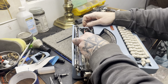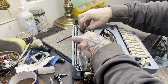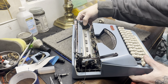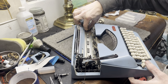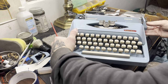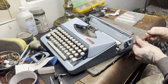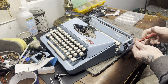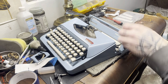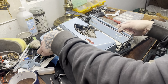On this opposite carriage cap, there's this inner screw for the topmost of this side carriage cap, and then it has one on the back, just like the other side. Oh, grab that spacer. There's spacers for these platen rods. So it's on the back, like so. Okay, carriage cap. Got that carriage cap off. This thing is wiggly wobbly.